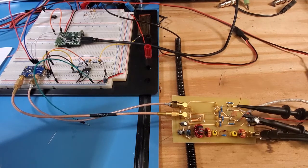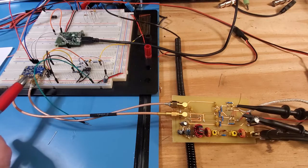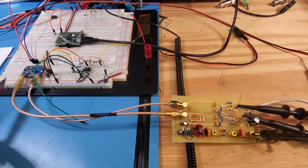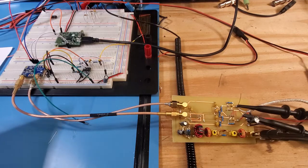The test equipment that you need, at least for these IQ style radios: you certainly need a multimeter to check the voltages around the circuit. You do need a signal generator — I'm using it here to inject the RF signal. That needs to be at the receiving frequency. This is a 40 meter rig, so I need a signal generator that can deal with around 7 MHz output. You need a source for your quadrature LO — the SI5351 is a great source to generate your LO quadrature signals around the desired receiving RF frequency. And finally, you'll need an oscilloscope.